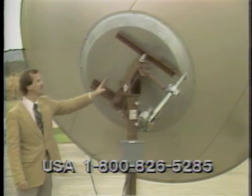The mount is secured to the reflector via a circular rear support pan, making it a very rigid mounting system. Considering the quality of the Qualtronics Nova stainless steel antenna, the strength and durability of the Nova mount, also incorporating the circular rear pan, and for the cost, the price to you of the stainless steel reflector systems, in comparison to the systems you're now using, it's really not that much more to go with something that's going to last and give you superb picture quality.